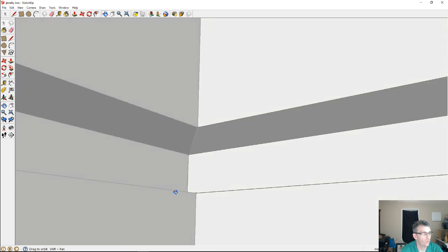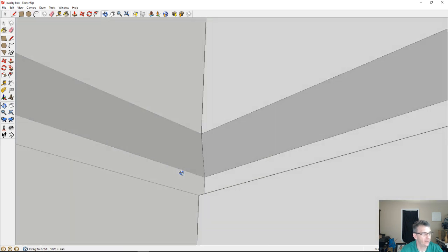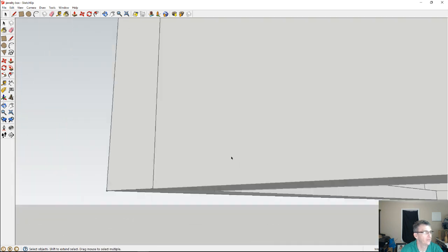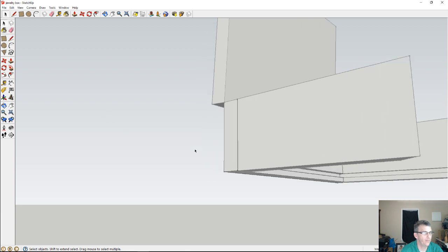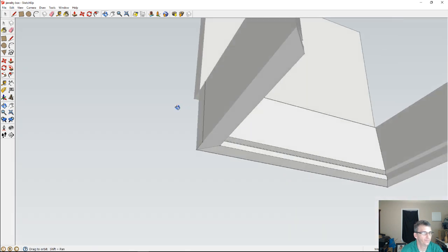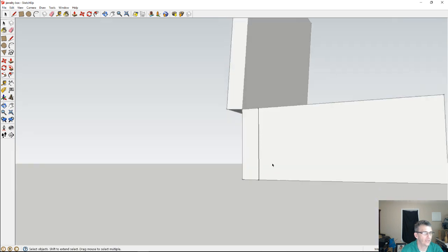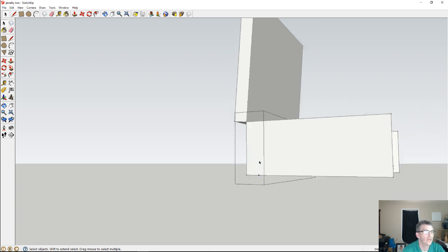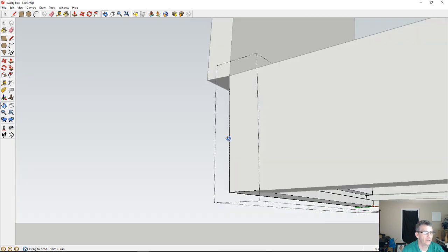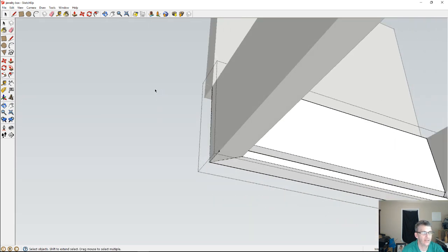When you put the two parts together, that 90 degrees, it closes off, and it's not seen on the back side of the board at all. And this line doesn't belong here, so bear with me a second. It's not seen on the back side at all because the groove doesn't go there. It's limited to that 3/8 of an inch.